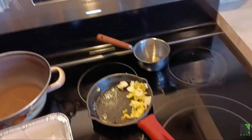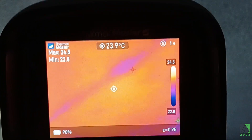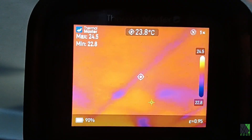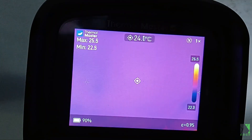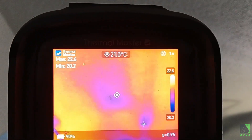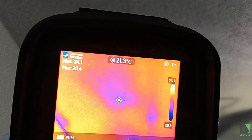In troubleshooting and engineering fields it's so handy to have a tool like this. Every single house ever built has thermal leaks — places where the insulation isn't great and heat is basically leaking out. This footage was filmed in winter and you can see there are quite a few cold spots on the ceiling, which is no surprise for a 20-year-old house. If you want to do insulation work, use a thermal camera to target the worst spots first because that's where you're losing most of your heat.